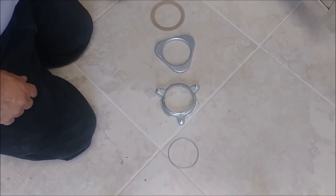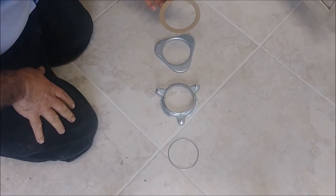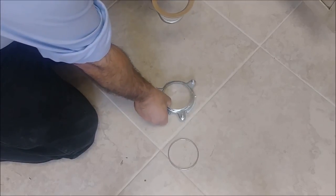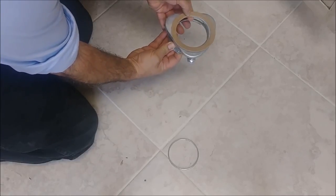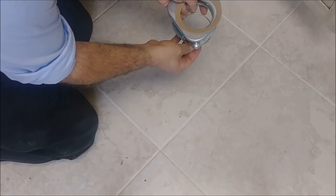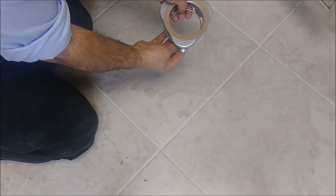The first item is the fiber gasket, then under it goes the backup flange, then the mounting ring — that's what holds all these items together. This is the sink flange, and here is where the snap ring will hold everything in place. I also notice there's excess putty here that we need to remove, so I'm removing the excess putty from the flange now.